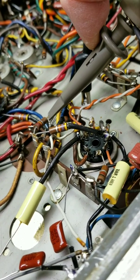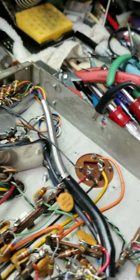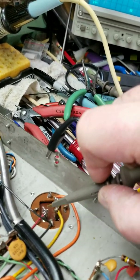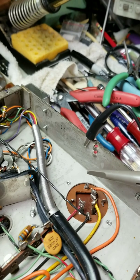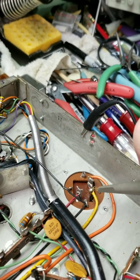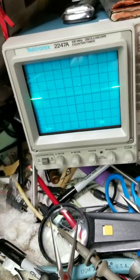So that's the basics on how to check a filter capacitor with a scope. We have another cap over here — I'm going to check that one. Very carefully removing the ground and regrounding over here. Be careful that alligator clip doesn't pop off and touch something hot. This one is actually the bypass capacitor for the cathode bias, so we don't worry too much. I checked that — it's perfect, plenty of capacitance. These two are power supply caps: flat as a pancake, no ripple. The other one also nice and flat, not even the slightest trace of ripple.